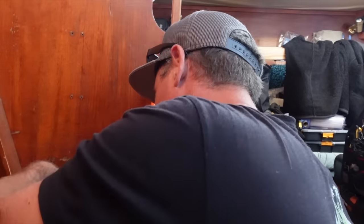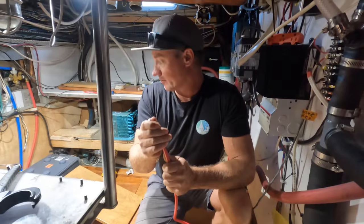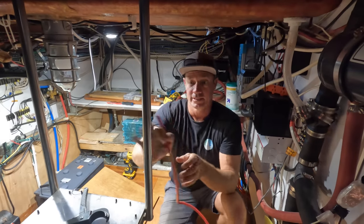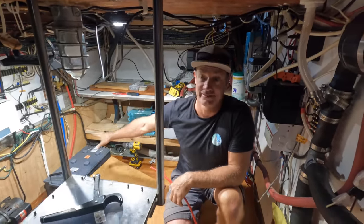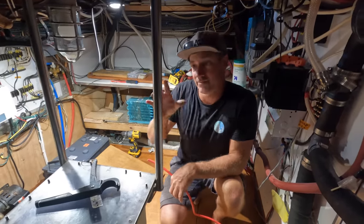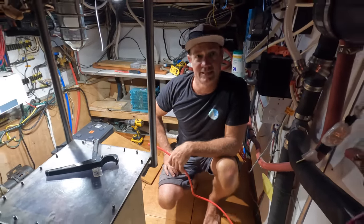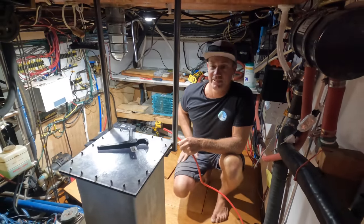The freezer will be off but the other fridge will stay on. There's a fair bit in the freezer but it's cold in there and it shouldn't be off for too long. This is where the other two batteries are; they've got to be removed as well. We've got a terminal back on one battery and we'll use that to give us power up to the main board — that'll allow us to have lights, flush the toilet, and the charging unit will remain on charging just the one battery, which is pretty much dead. So it'll basically be the battery charger running, covering lights, the freezer, the water pump — whatever's on our switch. It's only light loads just to get us through until we get the install done.